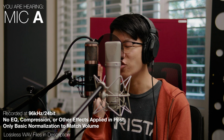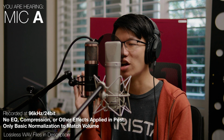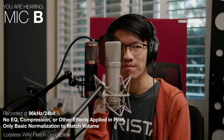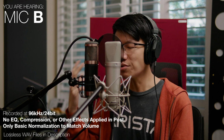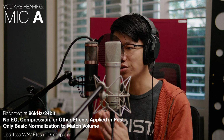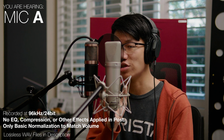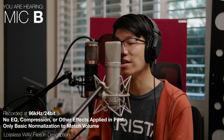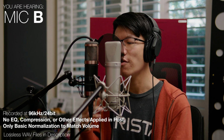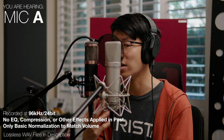Again, the JJ67 is by no means trying to clone the U87 or any of Neumann's microphones. It's trying to be its own thing, but we're just comparing it here because Neumann has been known for just the gold standard, right? In terms of the circuit, these two circuits are also very different. Although they're both not tubes, so they're JFET circuits, the output is actually very different. The U87AI uses a transformer output to provide a balanced output signal versus the JJ67, which uses a transformerless design from Schoeps. It's a very common design, and so that will provide different sonic characteristics.